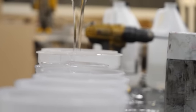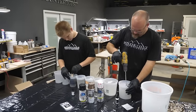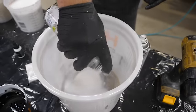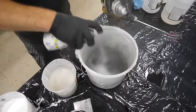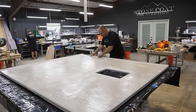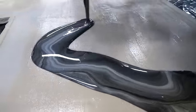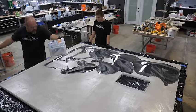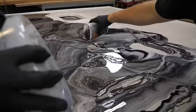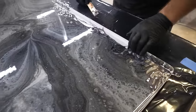When I was doing this back wall, I had the yin-yang thing going on — I wanted part of it to be dark and part of it to be light. I love adding diamond dust because it gives that natural level of shimmer that looks like mica flake. I'm doing an exotic pour where I take all those mixed colors, put them in the same bucket, and I've built a tape dam to contain that bucket. I pour that out nice and easy randomly across my surface. Don't overthink it — pour it out random and you'll be amazed at how it comes out. For the yin-yang theory, this was the darker half, and I'm going to pour a second coat that's a little bit lighter. This was a giant back wall, so go ahead and do it in a couple of pours.